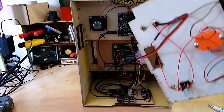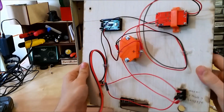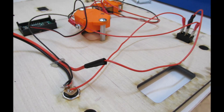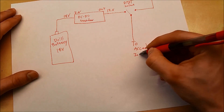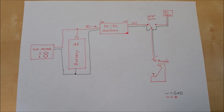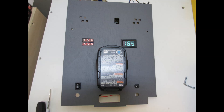We can disconnect the rear panel because I tried to make this an all-in-one modification — if you don't want to do it, just replace the rear with something pre-cut. It looks a little complicated because the wires are not cut to their proper length, but the circuit is very straightforward since we're using pre-assembled devices purchased on eBay. The total cost of this modification is under $11, because we already had the battery pack and were just buying cheap pre-assembled circuits from eBay. I had to desolder some Molex connectors on the regulator so it would fit flush into the rear of the cabinet for a clean install.